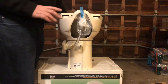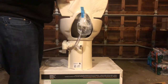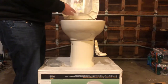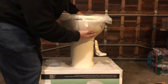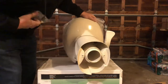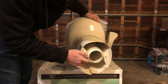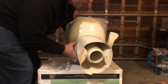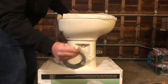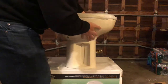About five years ago you used to get some chemical with it when you would order it, and now you just get the warranty card, instructions, and the base. That's where you would put your flange. I like to put the flange on first personally, then mount my toilet — a bolt goes through here and here, then you put a nut on top on each side, and it comes with a little plastic cap that you can put on top to make it look good.